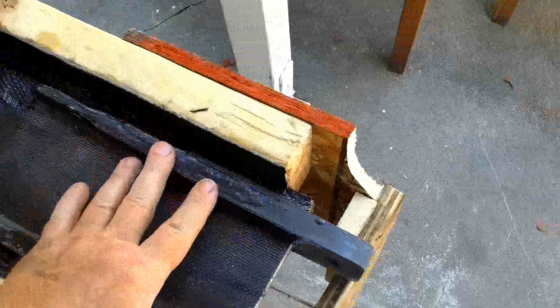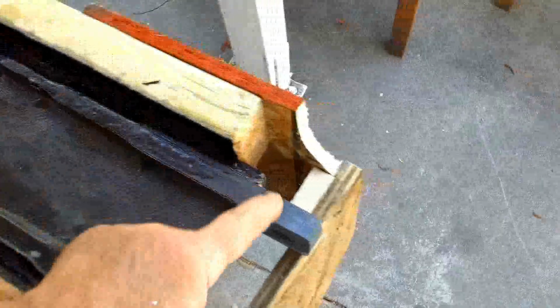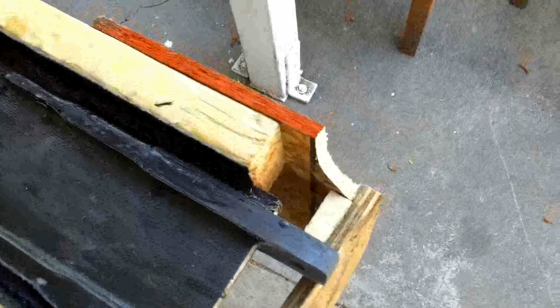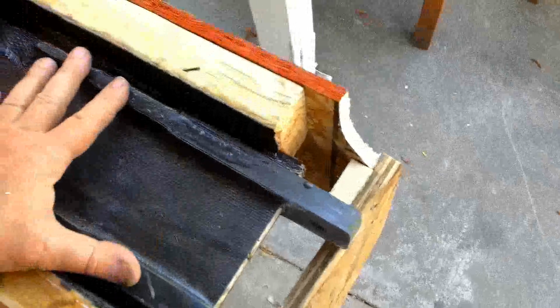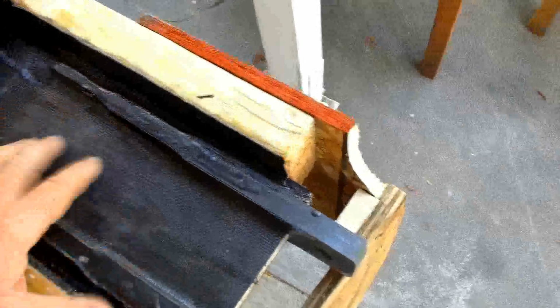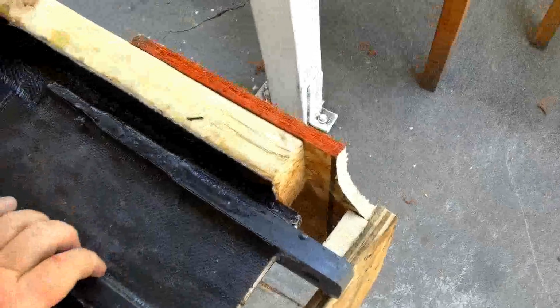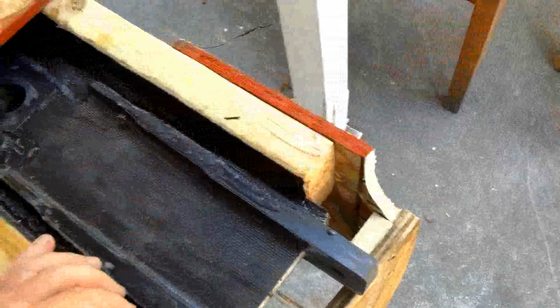These fittings are not the intended setup for the final aircraft. This would not be terminated here. This fitting would actually be this size, run all the way across to the other side of the cockpit to hold the other wing on. So these fittings are not representative of what would be on the aircraft. These were set up just for the test. Now these failed at a little in excess of 4.5 Gs, about 4.6 Gs in tension on that one.